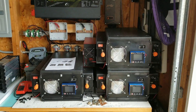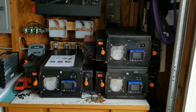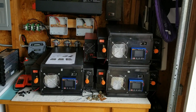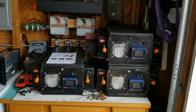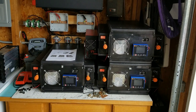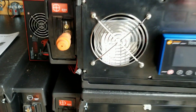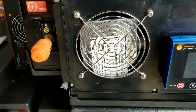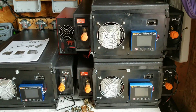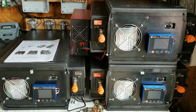What I got here is three BYD packs — originally they were 5.5 kilowatt packs. They've been used, heavily used by many accounts, so I'm expecting maybe three and a half kilowatts, and with the balancers maybe I can get four kilowatts out of each pack. I'll be doing some load testing later on. I installed Chargery 8T BMSs and 5.8 amp active balancers, hoping to get maximum capacity out of all the cells.